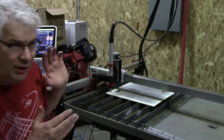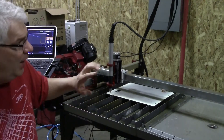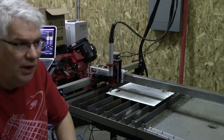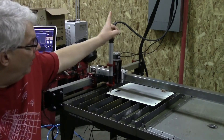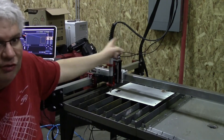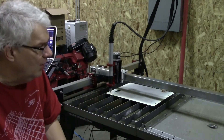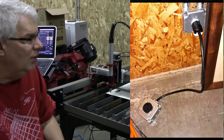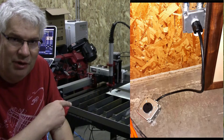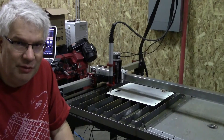Welcome back. We have the Crossfire Pro located in the correct position and we've rewired the back wall with 240 at 30 amps. You can see the sub panel right behind me — there are about nine drops along this wall with both 120 and 240 circuits. I went ahead and made a little adapter to go from the outlets the electrician put on the wall into my plasma cutter.